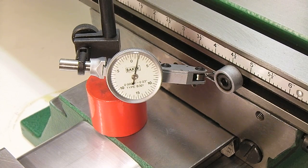Let's go back up one more time. It's just about on zero again. We'll go forward — it's moving, and it says six tenths of a thousandths. So now we'll go into step mode, which moves one step at a time, which is one thousandths.